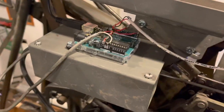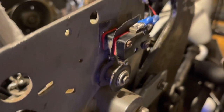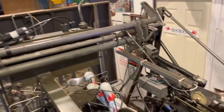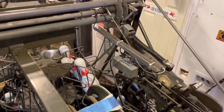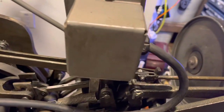This is the second ball solenoid that I'm trying to get working. The Arduino board right here is what I use for the automatic scoring that works up on the laptop up front. There is a switch right here on the side of the detector — every time the machine cycles it pushes that switch one time, and that's what tells the camera when to score. Right here, the blue thing is a mercury switch that controls the crown that lights up if you get a strike. There's a little mercury thing in there, and when you strike it drops down and completes the circuit inside the mercury switch, which makes the crown light up.